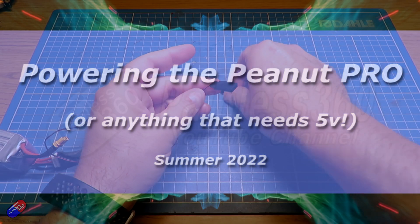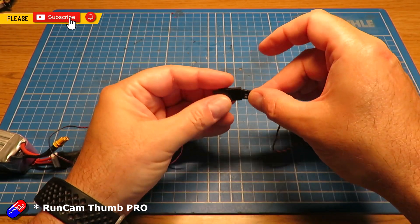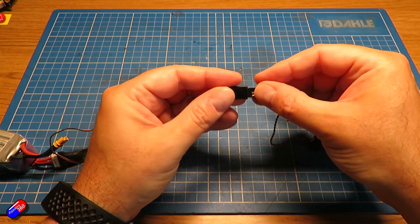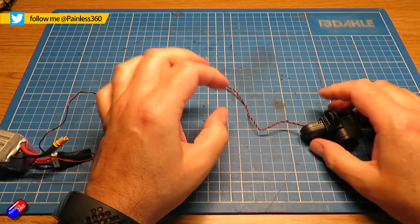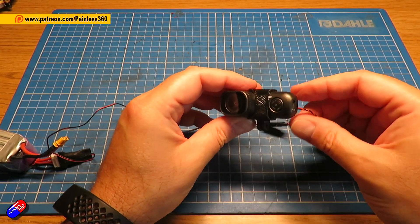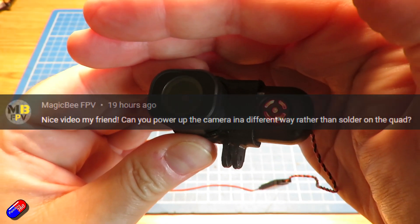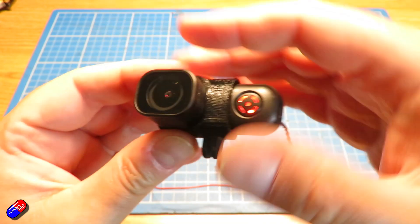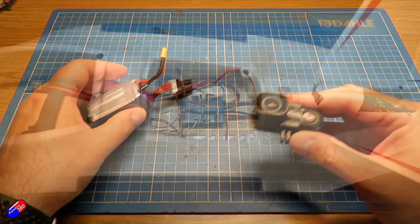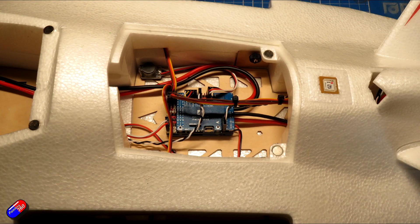Hello and welcome to this quick video about how I am powering my P-NUT from the balance tap of a LiPo battery. A couple of weeks ago I looked at this new camera from Runcam, the new P-NUT Pro, and I had a great question from a chap called Magic BFPV asking how would you power that if there isn't a 5V supply to plug it into. If you're using one of the larger flight controllers that has lots of spare outputs and a spare half an amp to power the camera, then it's pretty straightforward — you just plug it into any spare servo output.